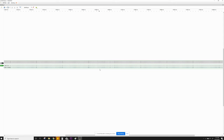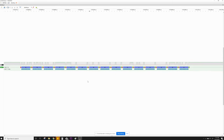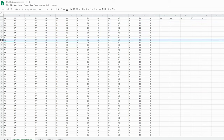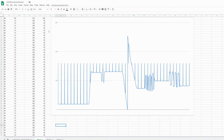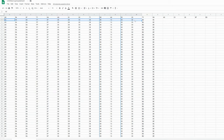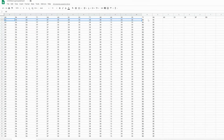Only these four bytes seem to be changing. Taking our sample from Pulse View and throwing the bytes into a UART analysis for normal serial communication, we have a list of hex data — which verifies it's operating at a baud rate of 115,200. Throwing that into Google Sheets and grabbing those couple of changing bytes, we convert hex to decimal to get a list of decimal readings, then create a plot. It kind of just looks like a number floating between 0 and 255 — easy to emulate. The other column of two bytes is just a CRC calculation for bit-checking the packets received by the motor, which is also easy to emulate as long as you know the algorithm.